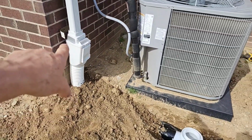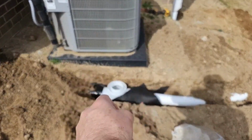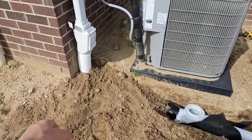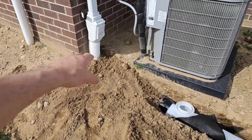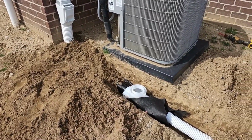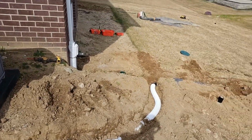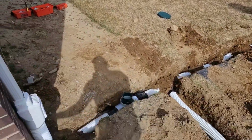We still have to attach that downspout. We go right into an inline catch basin. This is for shingle gravel. That's for organic material like bark, sticks, tree seeds, twigs. You'd be surprised what you catch with that. And then this will get your fines, your shingle gravel, any small debris, heavy tree buds that won't float to the pop-up. It's a beautiful example right here. Really nice job.